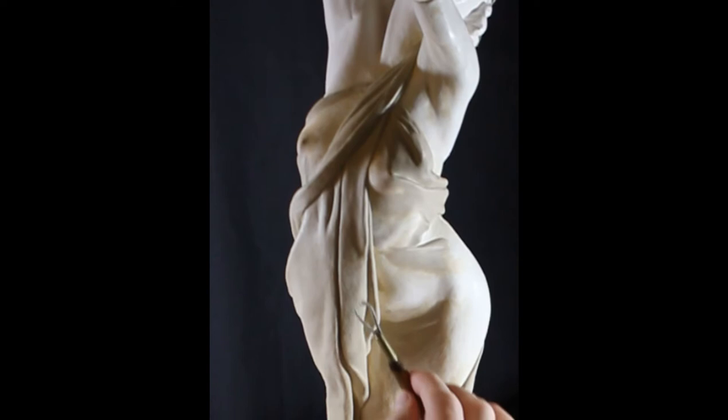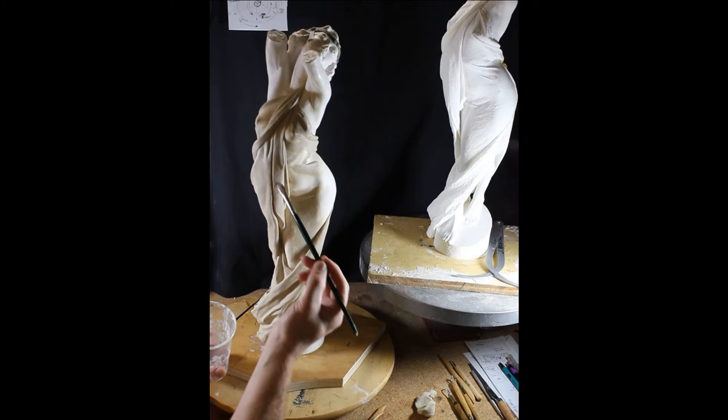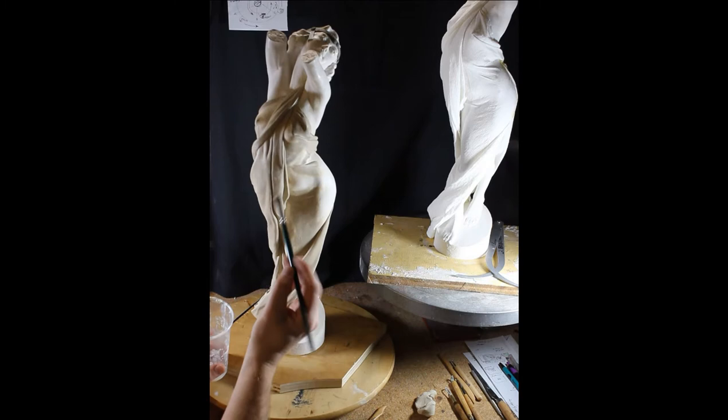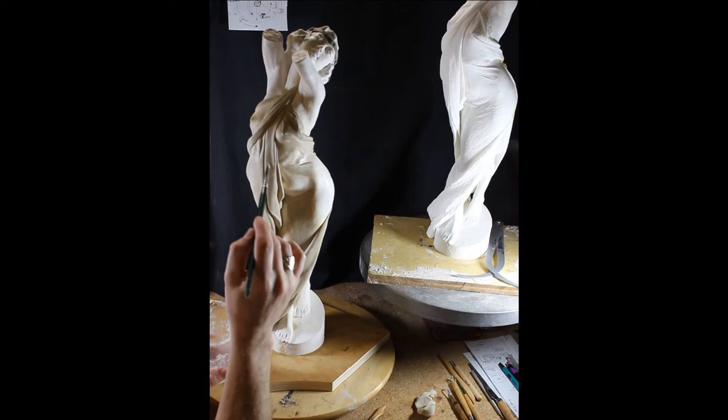So here I've got the rake marks, and maybe you like that. Maybe you want to take those details to the foundry or in your mold or however you're going to do it. The foundry has to replicate all that if they decide to cut up your sculpture. Sometimes they have to cut up your sculpture once it's in a wax in order to allow the ceramic shell to flow through it. And if they have to cut a window somewhere, they cut it down like that, they have to retexture all that.